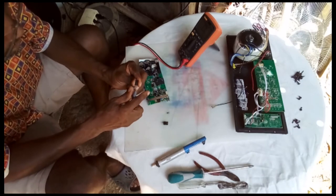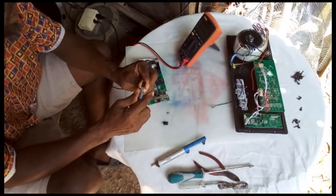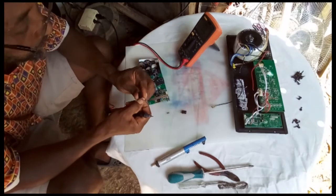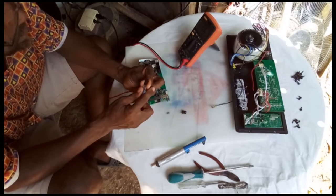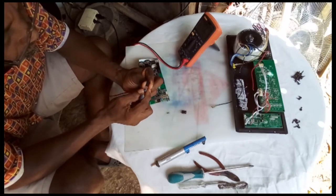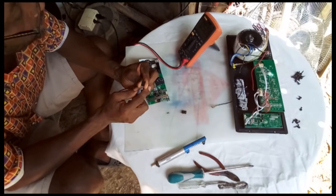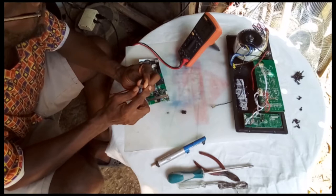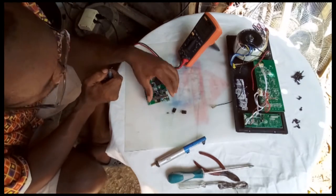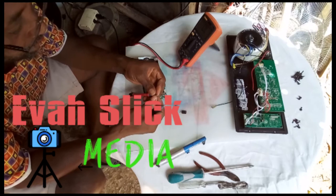The transistor is not reading — this one is zero. This one is zeroing out, that means this NPN is no good, showing zero zero zero zero, 0.000. The PNP now — showing 0.594, that is a good sign. From base to collector: 0.589, good sign. Testing it the other way around, supposed to get nothing — so the PNP is good but the NPN is not good. The resistors are not reading anything at all because they burned to the ground.